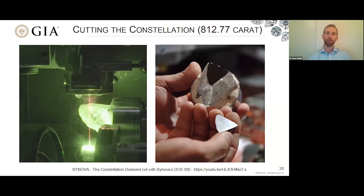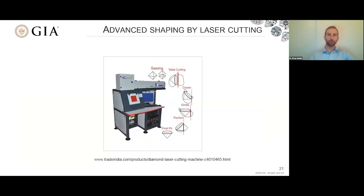Here are images of this water-jet guided laser being used to cut the Constellation diamond — the most expensive rough diamond ever sold at auction at $63 million. You can see the first cut made into this diamond: the cut surface is very sharp and well controlled, and the beam is very narrow and tightly focused. You can also do more advanced things with laser cutting beyond just cutting a plane — curved surfaces, wedge or pie-shaped cuts. There's a lot of freedom to shape rough diamonds. Combined with computer control, laser cutting can shape a rough diamond almost ready for faceting, doing the work of several previous steps.